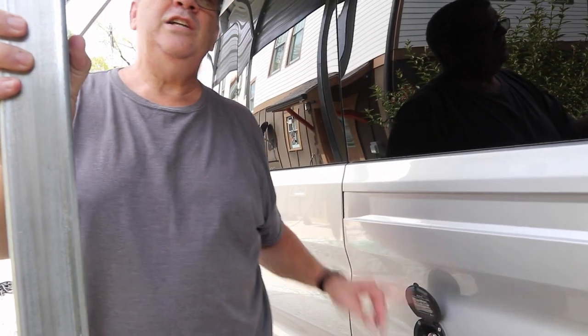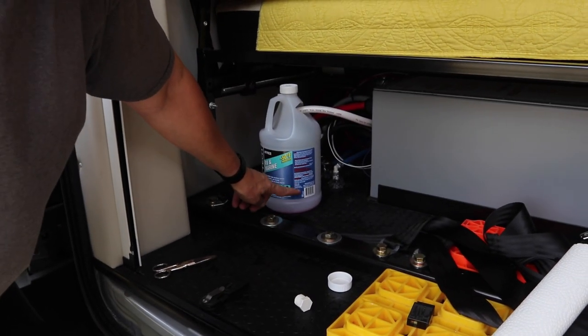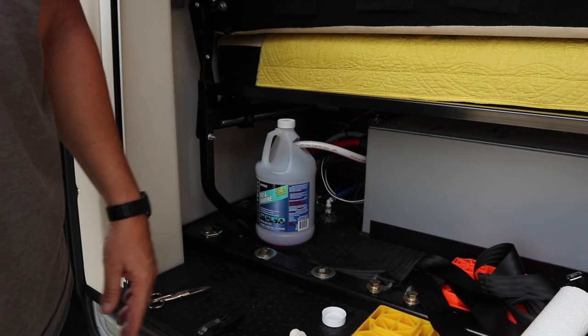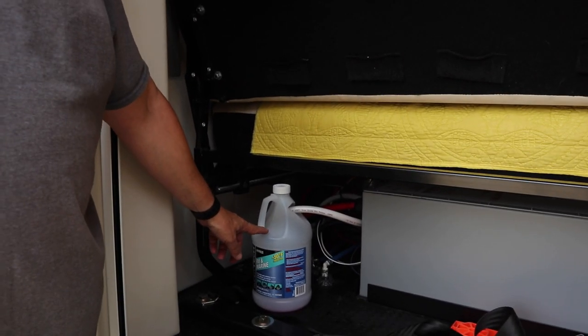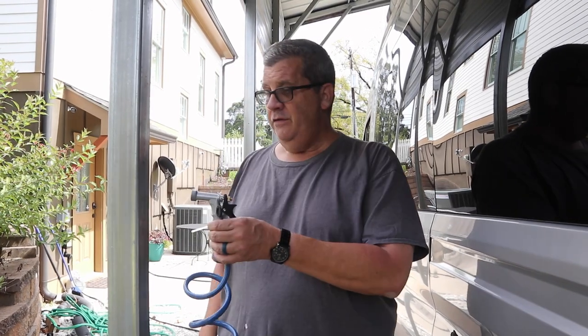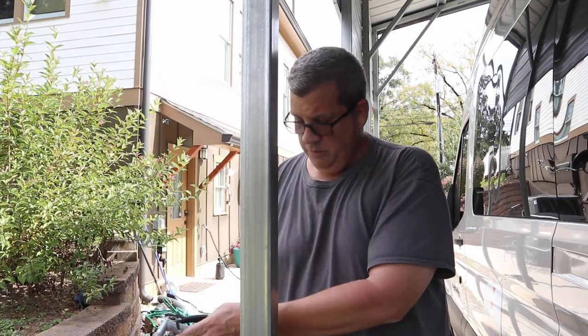So I'm going to go inside, turn off the water pump, and then let them unplug it. Look at this — you should use the whole thing; that's how much antifreeze it used. So to winterize, I used one gallon — actually, that gallon was a little low when I opened it, so probably about 1.2 gallons is all I needed. Now the water pump's off. This is how much pressure was in there — it would have sprayed really bad when you unplugged it. So push the hose in just a little bit, push that ring in and it comes right out.